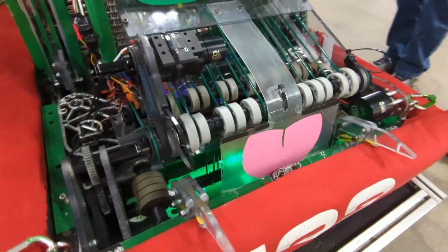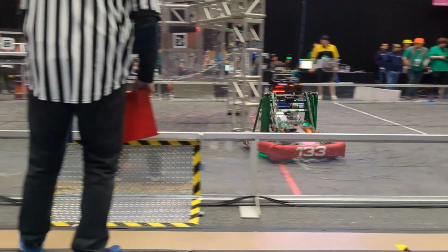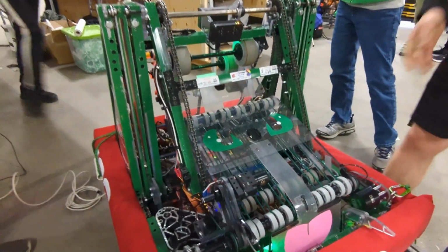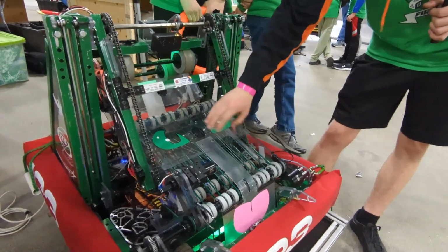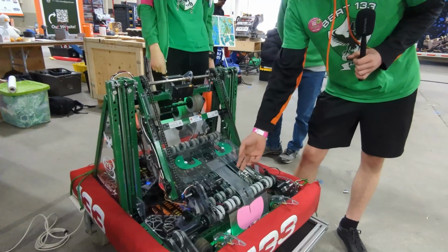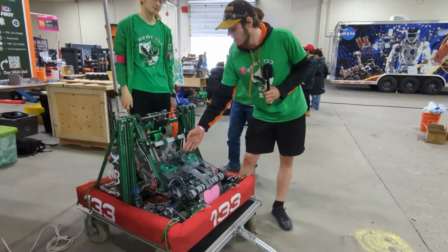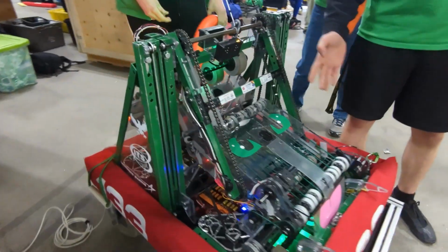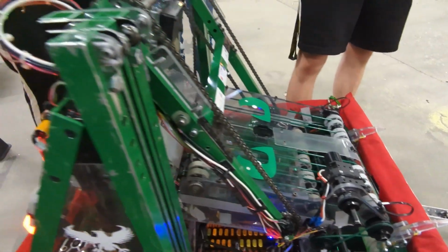Very interesting. So after you collect with your under the bumper intake, how does your handoff work? And what goes on with the arm system? So the note will go from the intake up into the staging zone where it can sit through our polycord almost belts, and we can spin up our shooter wheels to send it into the shooter wheels or hold it for when the arm goes up to score an amp.